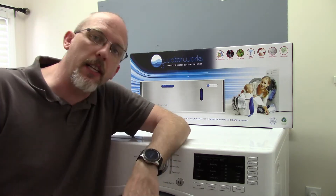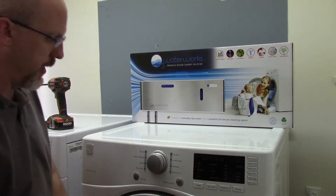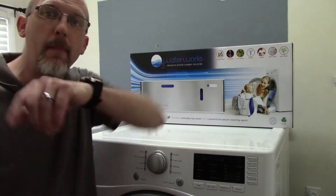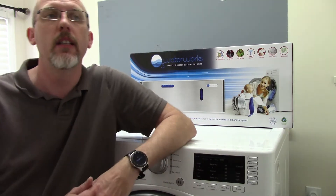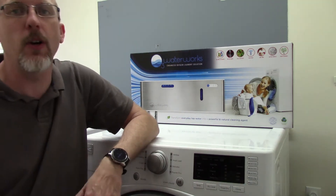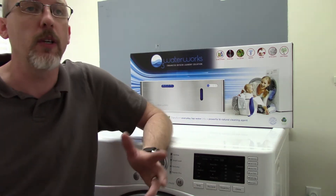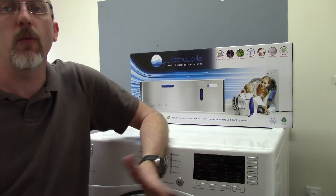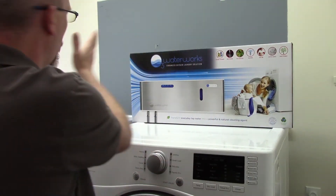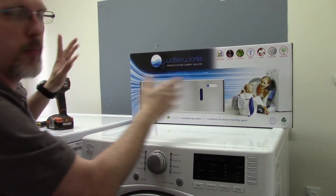Something a little bit unique in this space is our dryer is over here and our washer is over here, but the connections in the back are swapped. That's because of the door configuration. You can swap the door on one of these dryers, but you can't swap the door swing on the washer. We're stuck with what we were and didn't want to block ourselves out. So the hose connections are over here for the washer, and everything for the dryer is on the other side.